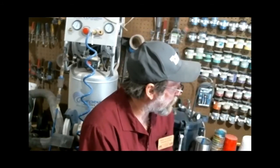The other thing is buying the amount of resin that you're going to use. Again, with that shelf life, they sell it all the way from, I think, pints to 80-pound kits, which is basically 10 gallons of resin, and that's what I buy it in. Obviously, the bigger quantity you buy, the cheaper you get it, but you better use it within your shelf life. So try to keep that in mind.